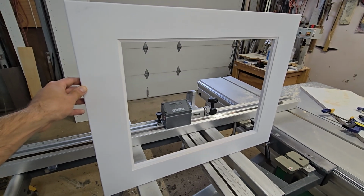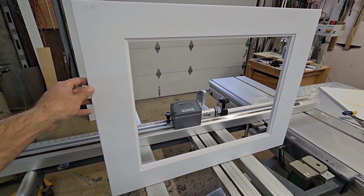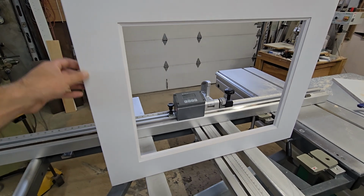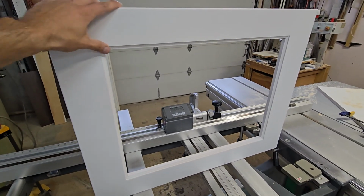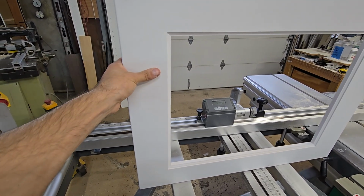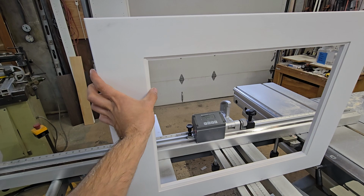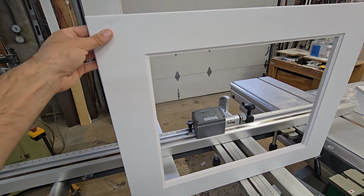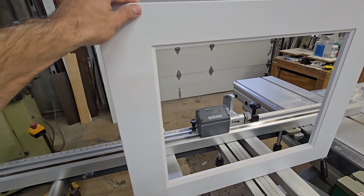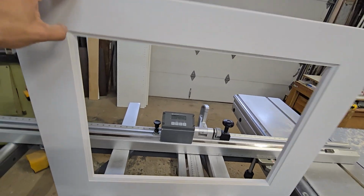I want to show you how ridiculous this request is for a Jenn-Air under cabinet beverage cooler that's panel ready. So clearly, this door frame has to be oversized. It's generally not going to accept the overlay for a typical 2 3/8 door. You have to make this frame oversized to cover the portion of the panel ready door on the fridge. So right there, you need a custom panel, right? Because you're not going to be able to put a regular prep for glass door panel on it.